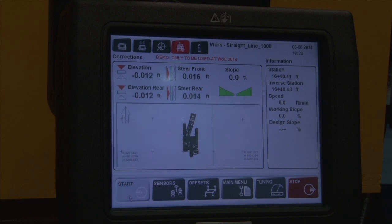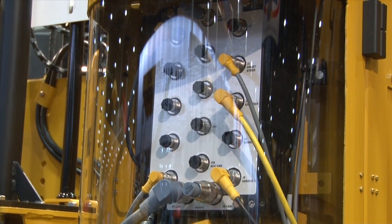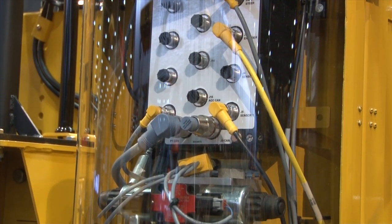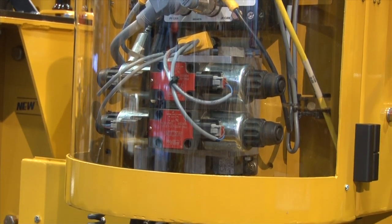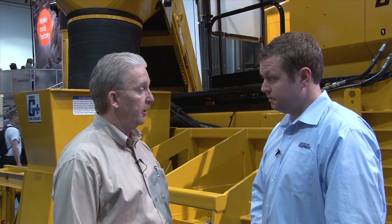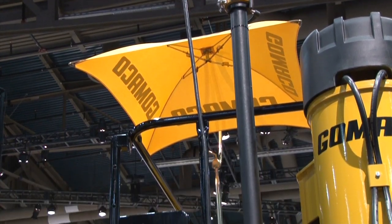What is the G-Box? The G-Boxes are put out on the legs where we have a little mini controller for each core of the machine — each leg on the machine — to control the functions that are based out on that portion of the machine. Another cool feature is the console. We've redesigned the framework and the console so that the operator can reposition the console into any different position he wants to put it into, to better view what he's actually producing with the machine. We can also put a rear-view camera on — the contractor can move it to any place he wants to view during the operation, and the operator will be able to see it right up on the control console.